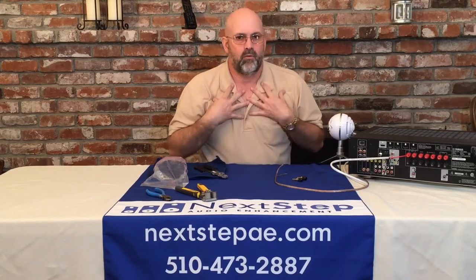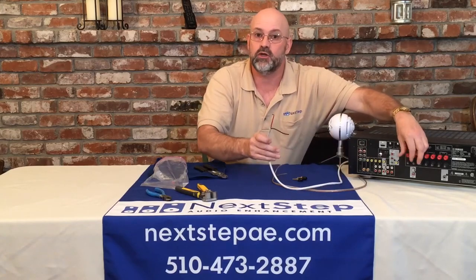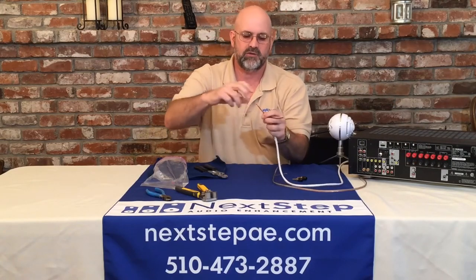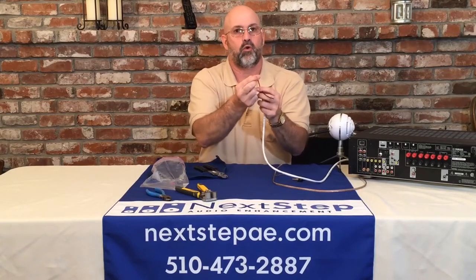But we're professionals. We have other ways of doing things. So here's what we're going to show you is the same tricks that we use that you can use to make this go a little easier, a little cleaner, a little faster, and make it look a little better at the end. So instead of stripping off like half inch or 3/4 inch like what we have here, we only need about 1/4 inch here.